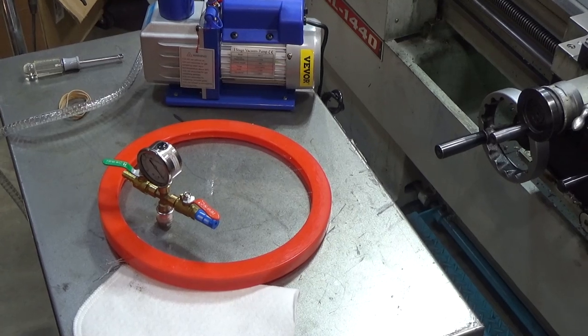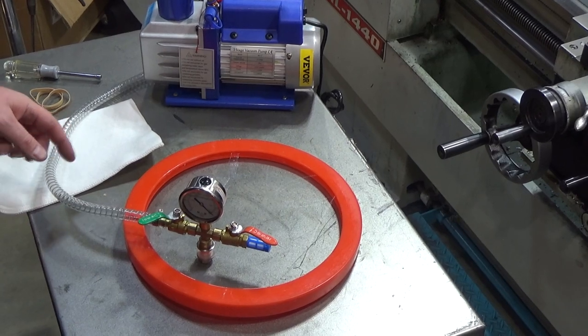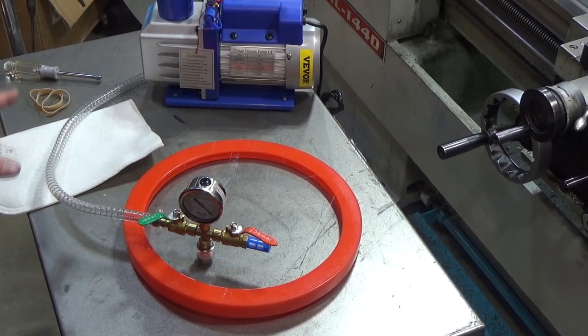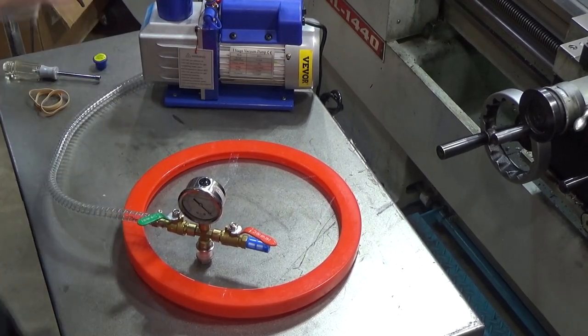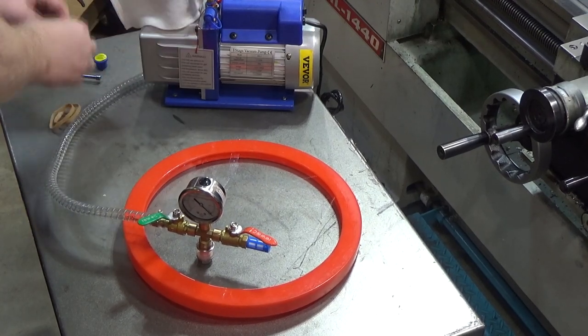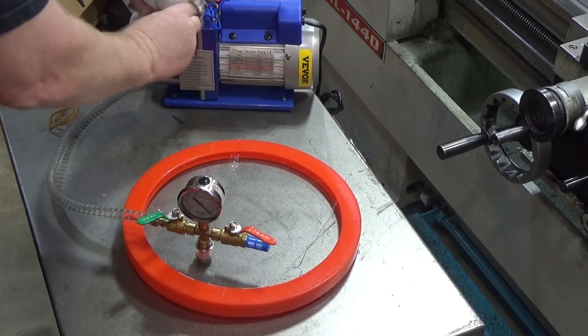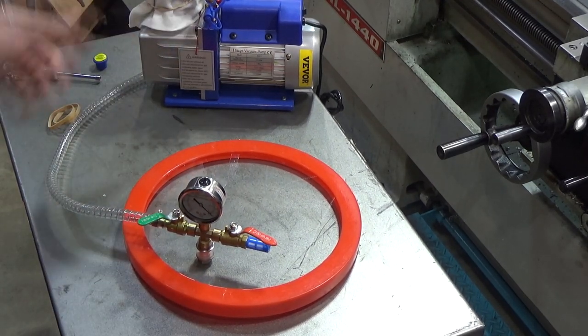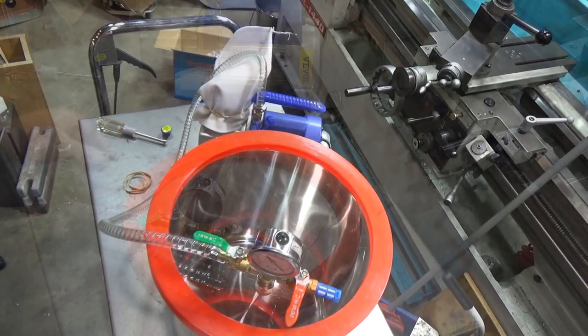As an observation, taking the hose on and off this barb is going to be a bit of a pain. If you're going to frequently assemble and disassemble the setup, you'll want some sort of quick connect if they make one for vacuums. Got to remember to remove the exhaust cap, and I'm going to put the filter sock over it to collect all of the mist. Some of the mist is just water vapor, but I'll cover it so I don't have to breathe the vapors.